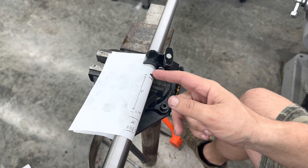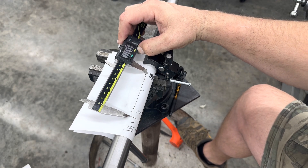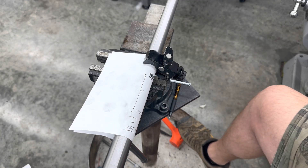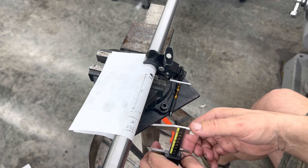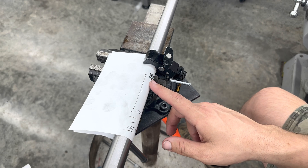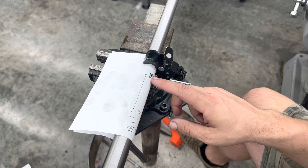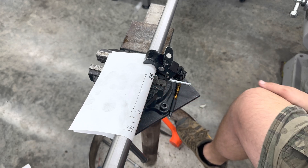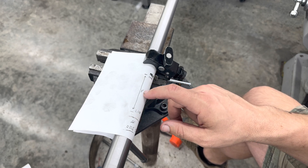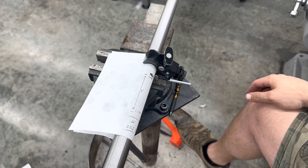I did this over a three-inch span. I zeroed out the calipers, made marks at three inches. So those two marks equal three inches, and then since we wrap it in paper I measured both ends — we got 1.089 and 1.110. We subtract one from the other and we get 21 thousandths difference between the big end and the little end. Over three inches, that equals 7 thousandths per inch of taper.